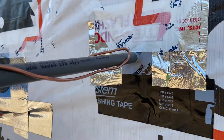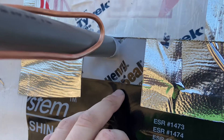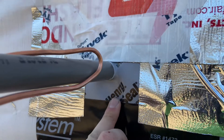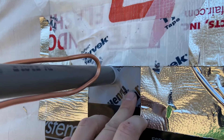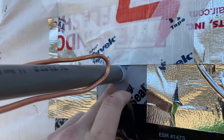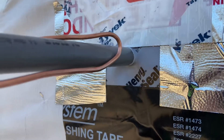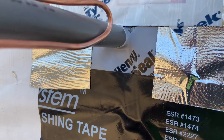This is half-inch PVC conduit — same concept, but I used a different product here. This is called a Henry Flex Seal. For small pipes these are way cheaper — about $15 for a pack of 25 of these little sheets. It's basically a square membrane. You cut a hole slightly smaller than what you need, then just shove the pipe through. Works really well. I had to order these online — Google 'Henry Flexi Seal' or 'Flex Seal' and that should get them to you.